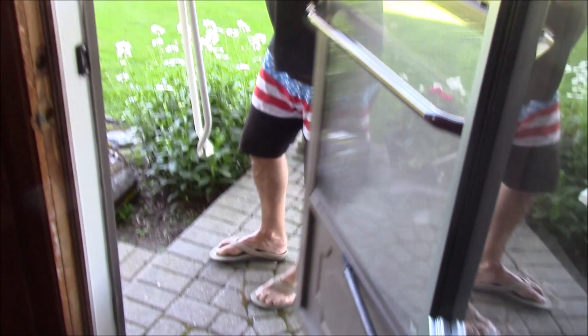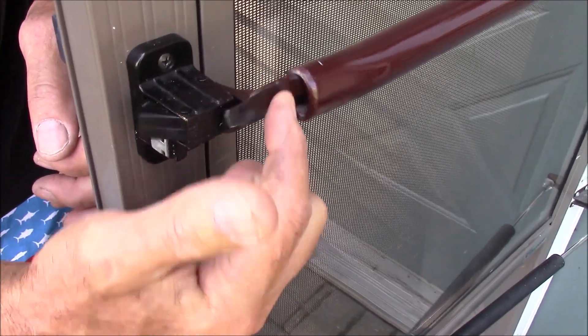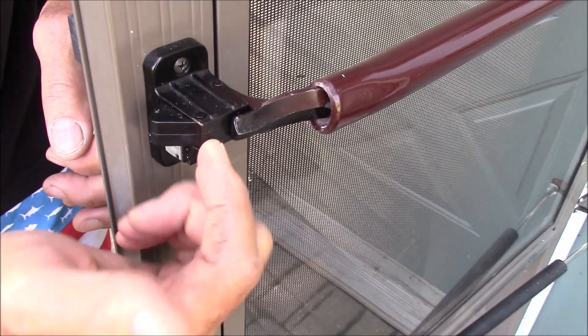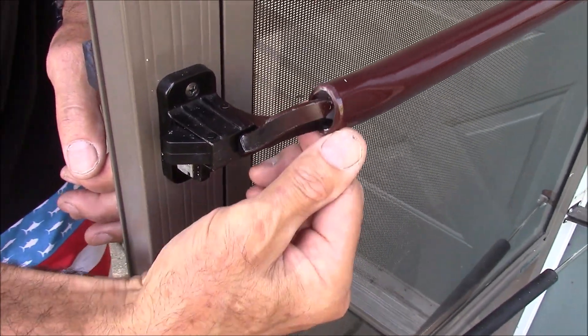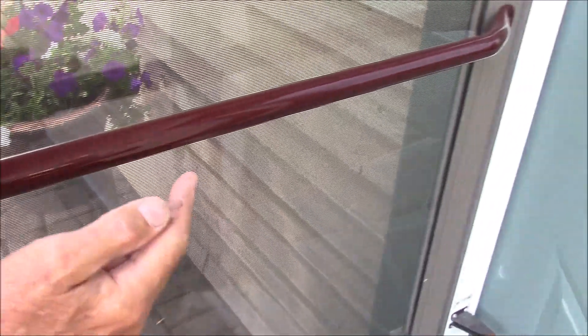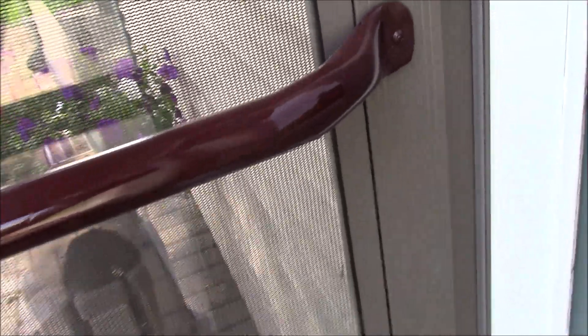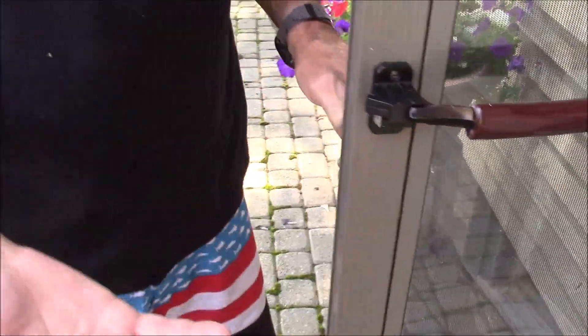I tried to oval the PVC a little bit, and I had to take the handle of my door latch and grind it narrower so it fit inside the PVC, so it just floats in there. All I have is one attachment — one screw holds it onto the door — and it works the latch great. It's a little panic bar for getting in and out of your house. Bending PVC and making little tricks around the house — easy tips from MrHardware.com.